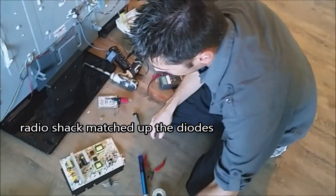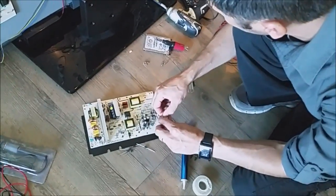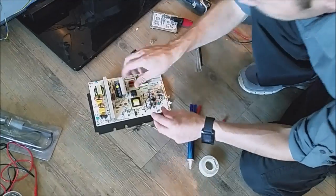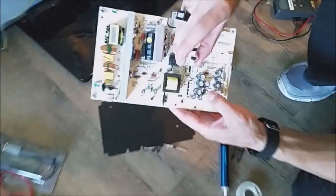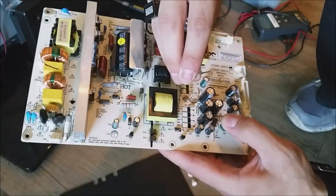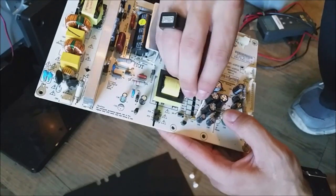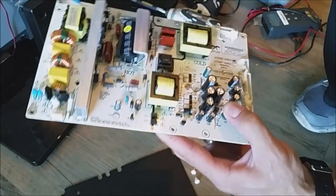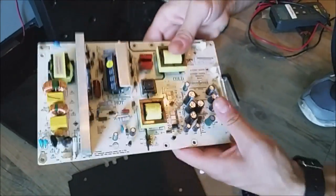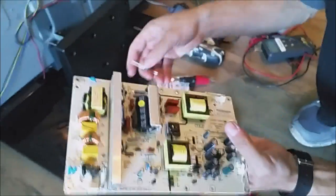We're back from the store — we got our diodes and we're going to be putting them in circuit, soldering it up, and plugging it in to see if it works. When you put the diode in, the stripe is the negative — that's the cathode — and the other side is the anode. Just make sure you follow the image: there's a stripe on the board and a stripe on the diode, they have to be matched. I replaced all of them — there were only two shorted ones, but I'm going to replace them all because they were reading kind of low even out of circuit. When in doubt, change it out.